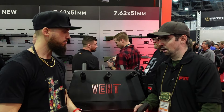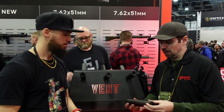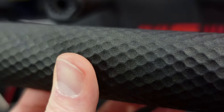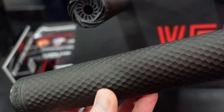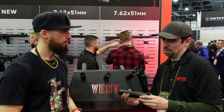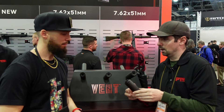The texture you see on the outside — because we are using additive manufacturing technology — that texture on the outside is actually mimicked on the inside as well. So it's a constant wall thickness all the way through, which gives you supremely higher yield strength than you would get normally with just a straight wall construction.